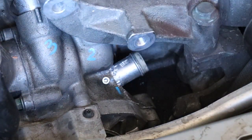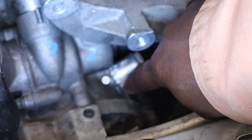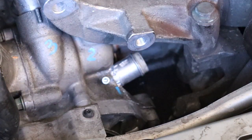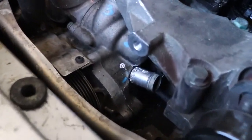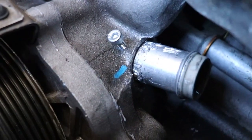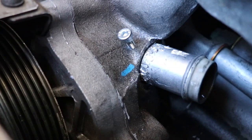Now I'm going to put a little fillet flange of adhesive around the entire circumference of this pipe to hold it in, because I can't get it out. So I'm just going to put additional adhesive on there, pin it, call it good. And then we'll go on to number two. See if we can get a good close-up of that. Stay focused. And there's my first pin for pipe number one.